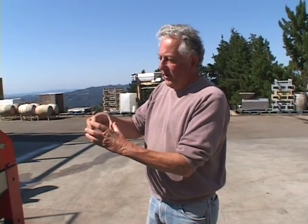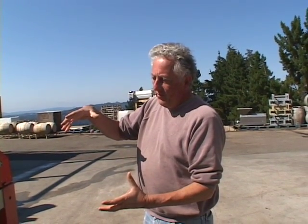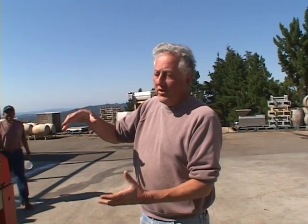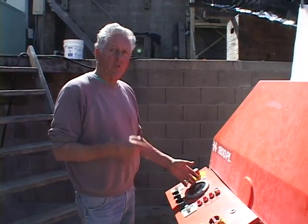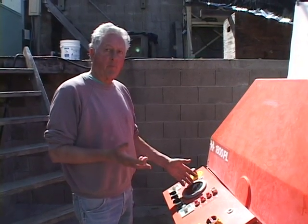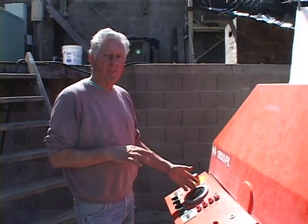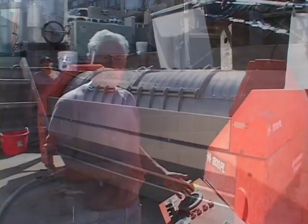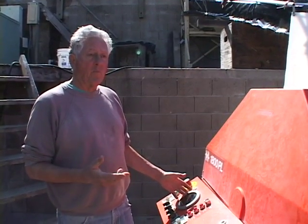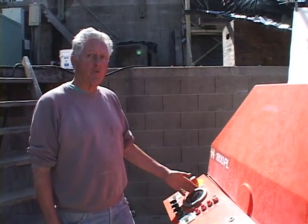When collapsed it might be 6 inches in diameter, but it fills from the end and could go up to maybe 16 or 18 inches in diameter as it forces out against the cage with the holes in it. Then you turn off the compressor and tumble the press — rotate it, break up the cake, break up the grapes, the bunches. Then you stop it and press again. You might do that three times. It might take a half an hour or 45 minutes for that first pressing, and we'll get 80% of the juice out at that minimal 0.2 bar pressure setting.